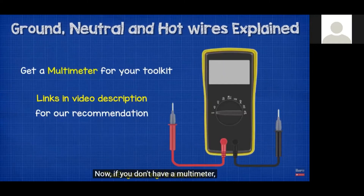When running wire, run it up as high as you possibly can above other trades. Nobody wants to go as high as they can, but if you're up higher, other trades aren't going to want to go up there — your wire is out of their way. They're not going to go up out of their way just to mess your stuff up. Run the wire up high, put it in a space where nobody else is going to mess with it, and that can help fix ground fault issues.